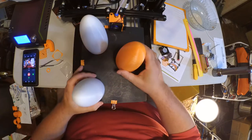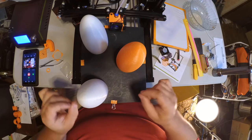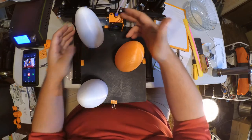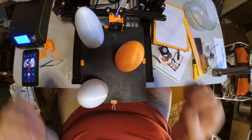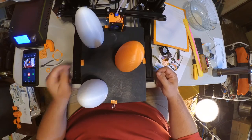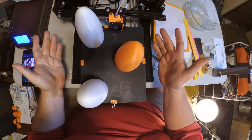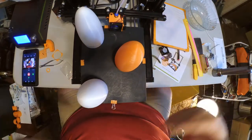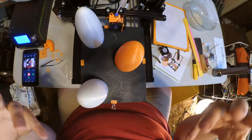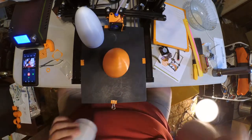Okay? So this is stuff that you have to be aware of, because the printer is dumb, deaf, and blind. It has no idea what is here. It could start extruding Kool-Aid, and it would not know. It's simply going to follow the extruder step commands you give it in your G-code. There's no feedback in this system, which is why we get spaghetti prints. Because it can't know. It has no way of knowing. There's no force gauge, there's no pressure gauge, there's no optical sensors. It has no way of knowing it's printing spaghetti. It has no way of knowing it's printing a nose cone.